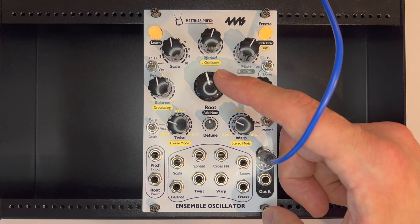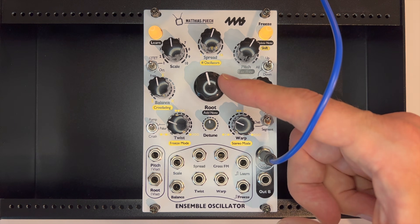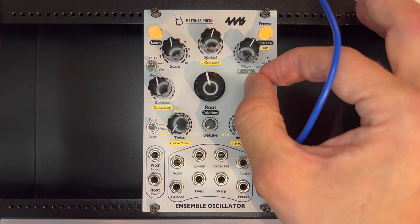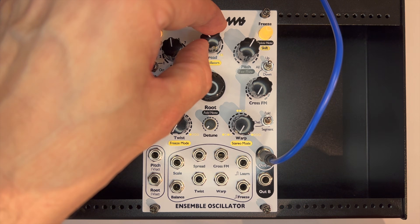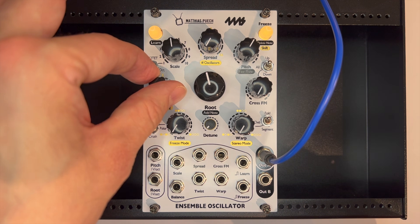In fact, we're going to have to kind of defeat what this does a little bit in order to tune this oscillator. So what I suggest doing is turning off the wave shaping just to get a purer tone, and then we need to turn the spread all the way down. We need to turn the balance all the way counterclockwise.